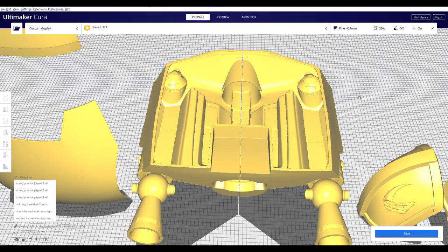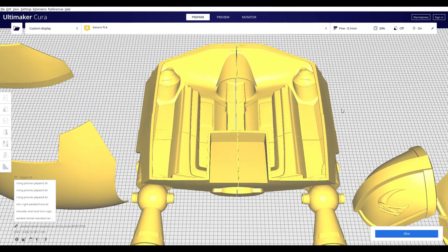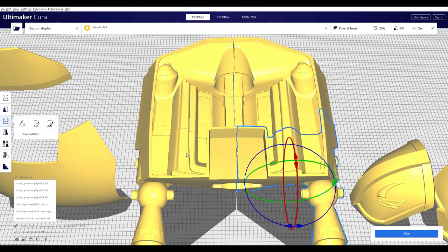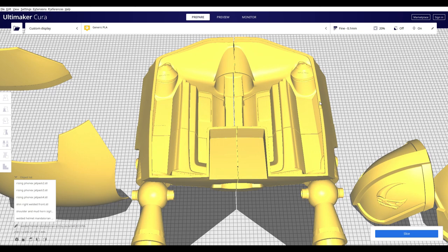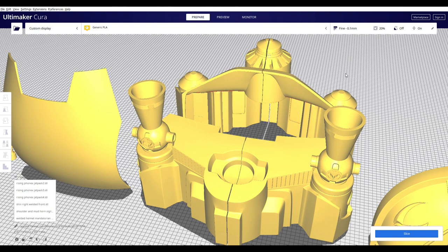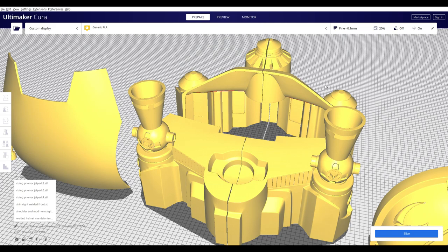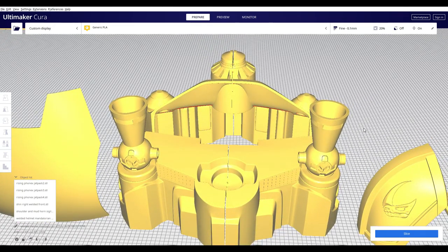Another big question was the jetpack. This thing is huge and there's no way it's going to fit on anybody's printer in one shot. So I loaded it up in the slicer and made four cuts to completely isolate each individual part into four separate chunks. Then I stood up each part on my printer and looked at each one individually in the slicer, making sure the tree supports were going in right and nothing would print wrong. It takes quite a lot of time, but this may be the best way to do it.